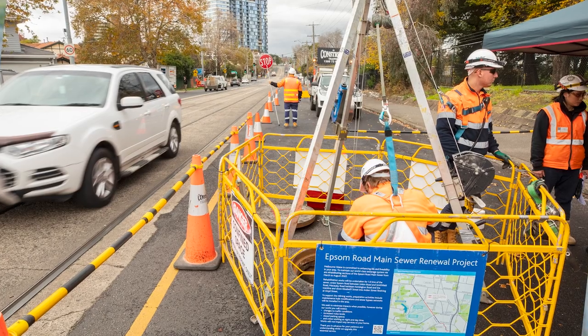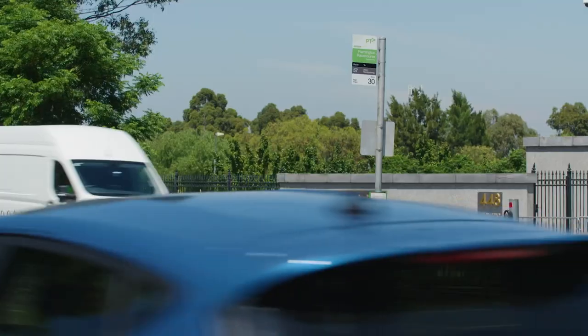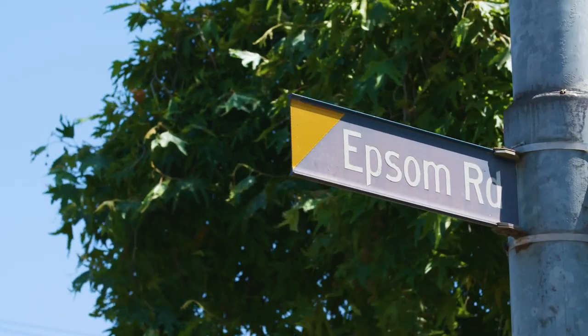Whilst generally suitable, inflatable plugs have a history of failure from a combination of contributing factors, including poor placement, internal pressures either under or over, and failure of lamination on the jointed areas — creating a high safety risk for confined space entry personnel working downstream of the isolation.